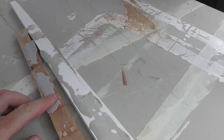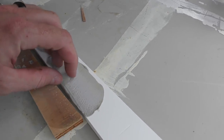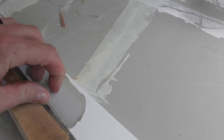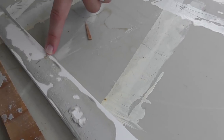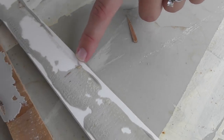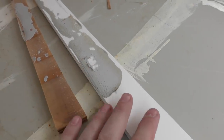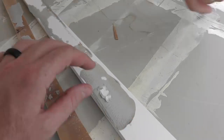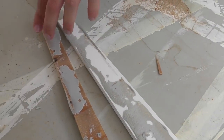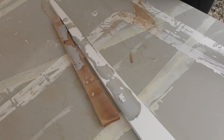Enough, yeah. So I think the reason why this actually gave way was that it wasn't completely cured, because if you look at this, I can actually move the adhesive around, and it's not dry in the middle right there. It did bond really well, though, because some of the wood, especially here, was left behind. Our biggest thing was trying to find something that would bond to PVC, and this looks like it has bonded to the PVC, where it's cured. Yeah, and same, bonded on the wood as well. So it kind of equally came off the wood and the PVC.